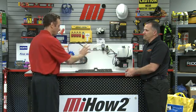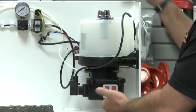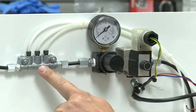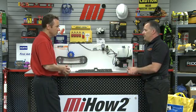Let's show how to set it all up. Just keep in mind that installation is unique in every facility. The first thing we have to do is find a 24-volt power supply — that will give us the mounting location of the pump. In our case, we've mounted the pump in this position. Next comes the manifold, solenoid, and pressure regulator. These also need to be mounted near the pump.